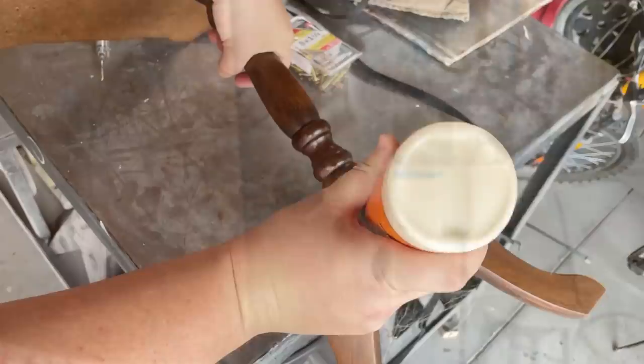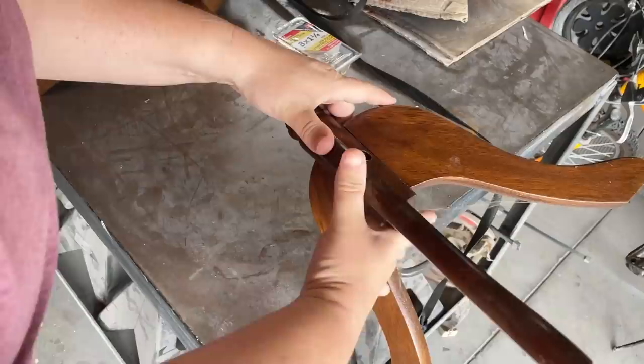This little accent table also needs some gluing and clamping. Luckily I've got access to the screws that hold all of the legs on, so I just need to pop some more glue into the dowel hole and retighten all the screws.